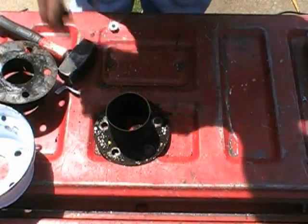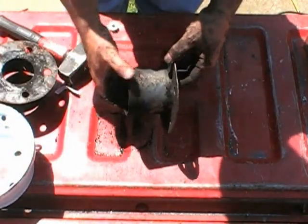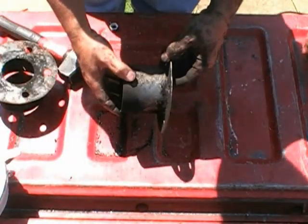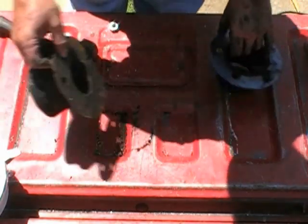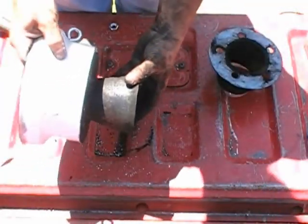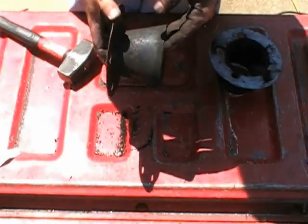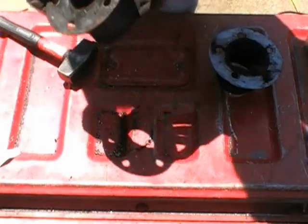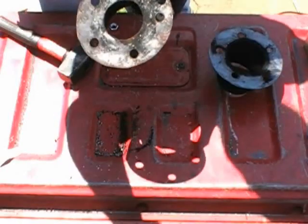Alright guys, this is the last piece of the puzzle, and this is the last extension piece that goes on the bottom of him. I just got through pulling this off of my gasifier that you see in the videos. Notice that it's a straight piece of pipe. Originally, I built one with the inverted bell, so the inverted bell went on like this right here, okay? And I didn't like the way it operated, didn't like the way it felt. It caused me issues and I wasn't happy with it. I was cracking tar with it, but it just caused me more problems that I don't want to bring in discussion as far as this video goes.